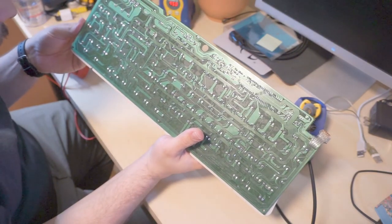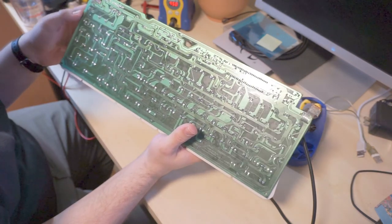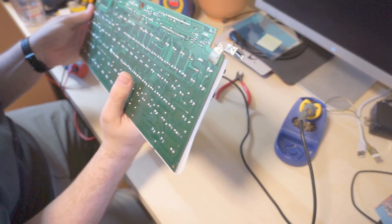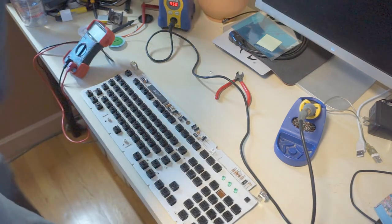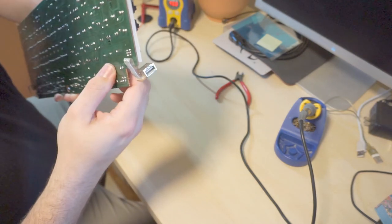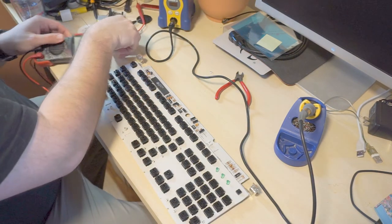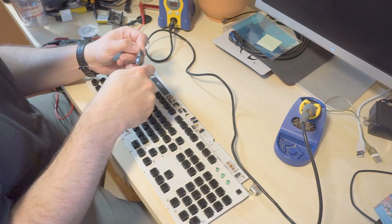So I don't know if there's a crack in the solder mask somewhere, or if something about sending those keys on the microcontroller just isn't working. I really don't know, but it's far from a deal breaker, because like I said, oops, that key is over there. So even though this other key doesn't work, I'm gonna pop it back in. I'm not gonna solder it down, but I will pop it back in. And I'll just have to remember that equal sign and 6 just don't work, for whatever reason, which is kind of a bummer, because I want this keyboard to be perfectly functional.